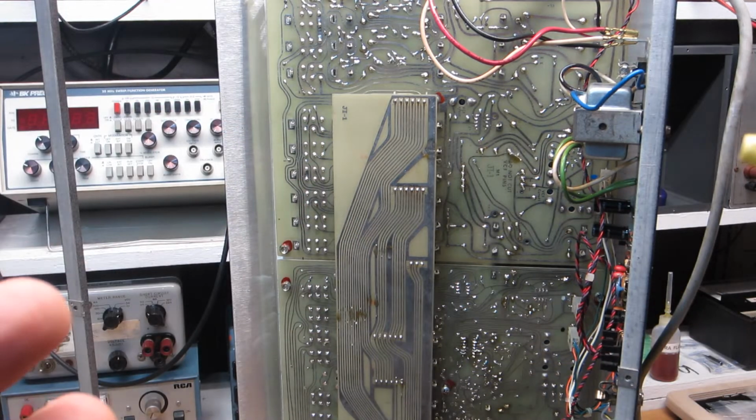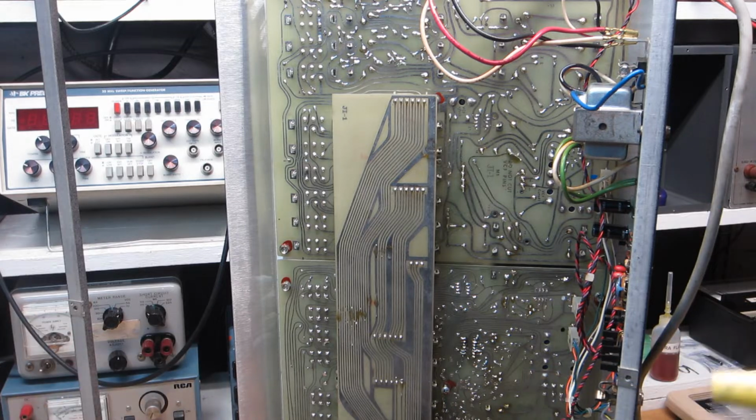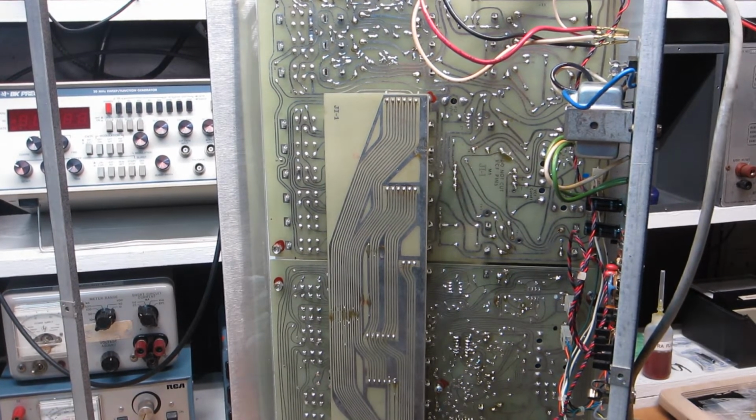knobs. So I was able to free up a lot of them, but there's several still that I'm actually going to have to remove from the board or boards and open up, disassemble, and clean out, because some of them are still pretty rough. And I got them to the point where they're working good enough, and most of them are. I flushed them and worked them until my wrist was burning, and I just had to exercise them to death, really, and flush them out, and then reintroduce lubricant after. But some of them are still just not responding as good as I would like them to, and in the end, I may even have to replace some. So the point I'm getting at is that I still have a lot of work ahead of me.